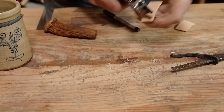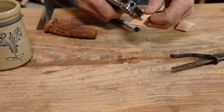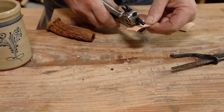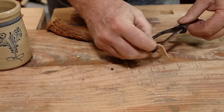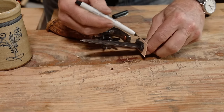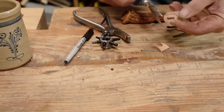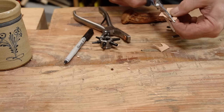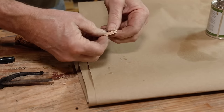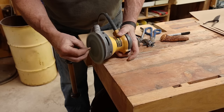I'm going to add a couple of spacer washers. These will conform a little bit better to the differences between the antler handle and the back of the guard that isn't perfectly smooth. So it will make a better fit up in the long run as well as adding just a little bit more interest to the knife in general. I'm going to make two of these spacers and go ahead and glue those together with contact cement. Once they're glued up, I can go ahead and shape them and try to get them to fit the shape of the guard and the antler as close as possible.